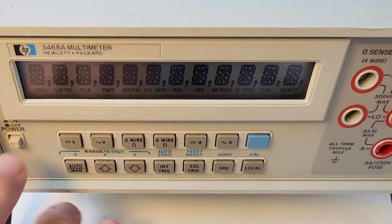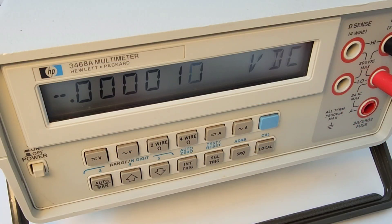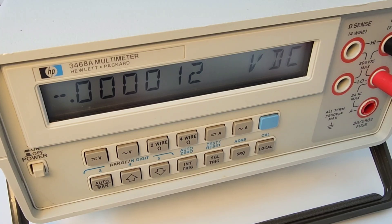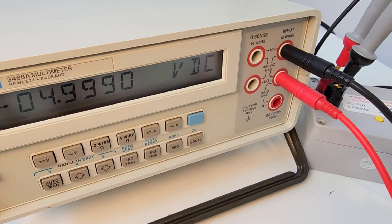Let's turn on the meter. Right away we're greeted with a self-test, meaning it has verified its internal calibration routines and all is good. By default it goes into volts DC. Look at that liquid crystal digit display — hard to believe this is 1980s. There's no REL on this bench meter, so with the probe masters together we do have a tiny bit of resistance you'll have to account for. Hooked up to a 5.000 voltage reference, and 40 years later it is still perfectly in spec — just out by one count. Amazing.